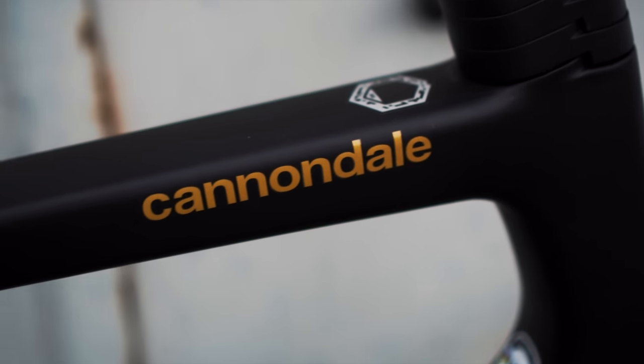An airfoil is typically a teardrop shape — more blunt at the nose and then a very gradually tapering tail. What we're doing is basically just using a very small portion at the front, so we keep the flow attached to the widest point of the tube at the rear. That means the wake is about the width of the tube. Rather than a long tail with extra weight and stiffness we don't need, we have a tube that is more or less the same proportions as a round tube. We're just redistributing the material, so it has the stiffness and weight of a round tube but with much lower drag — the best of both worlds.